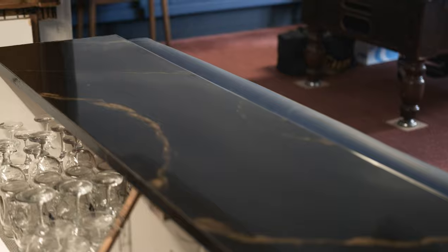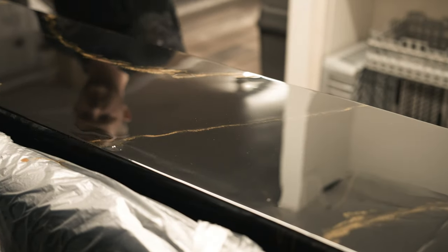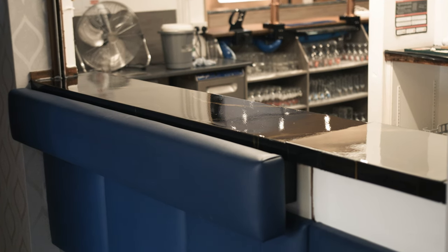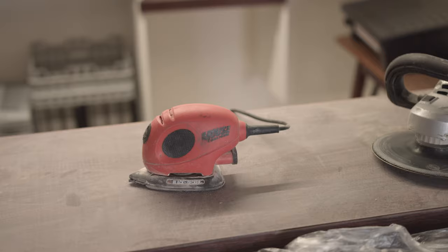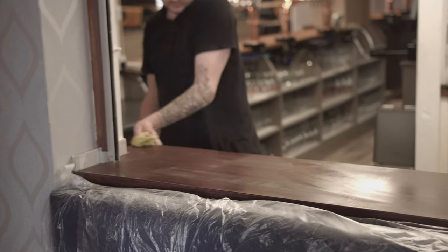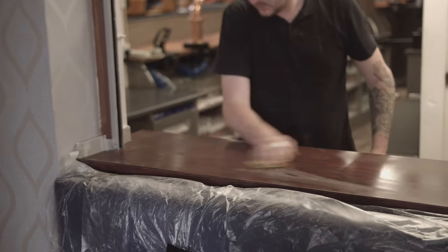Resin Coat Metallic Epoxy Countertop Kit is a great way to transform any existing surface. This premium formulation will create stunning and attractive metallic surfaces. The first step is to prepare the surface: thoroughly clean and, if required, sand the surface to abrade it and provide a key. Make sure to remove any debris this may have caused via vacuum or solvent wipe.